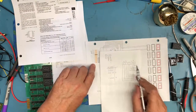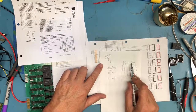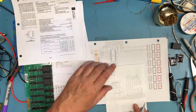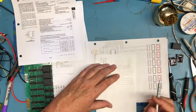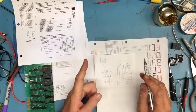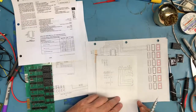And of course you can extend this out. It's just an easy way of doing binary coded decimal. It's representing the decimal value in the bit fields, 0 to 9, 0 to 9, 0 to 9, 0 to 9 in a binary way, and it makes doing things like this pretty simple. In one of my previous videos, actually a few of them, we've talked about the PIC32 series and the RTCC clock. The RTCC, the real-time clock calendar, has registers inside storing the time and the date as BCD encoded values. So it's common.